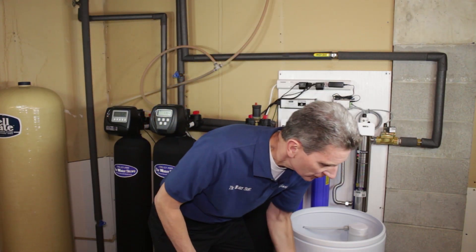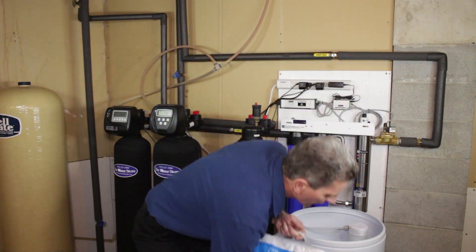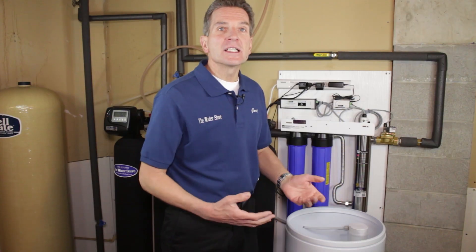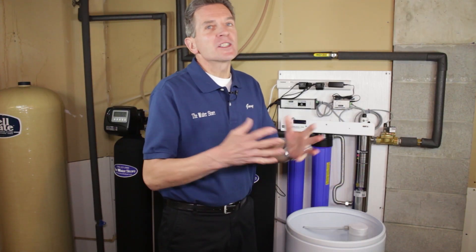So does that mean you should keep your water softener full of salt? No. Modern water softeners are very efficient, especially the Aquamaster line of high efficiency water softeners, meaning they use very little salt and very little water. Modern water softener salt, like this Windsor System Saver salt which I recommend, is also very pure, so there's very little dirt and very little to keep the salt from binding together. What compounds it even more is the salt reservoir on most water softeners is way too big for them. With all those things added up together, keeping it full invites a salt clog, which is very difficult to clear up and you want to avoid altogether.